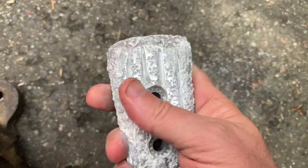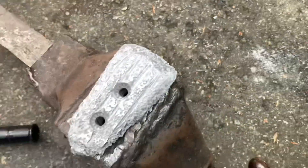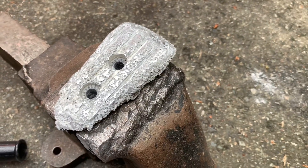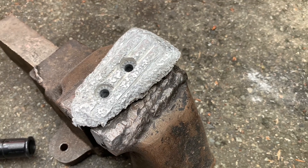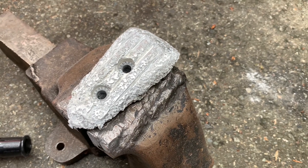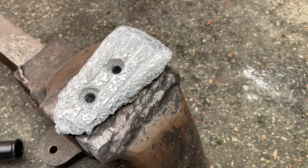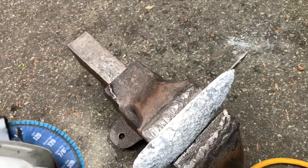This is the kind of thing you need to take care of, because on an aluminum boat without zincs, this pitting happens to the aluminum itself. I think this year I've switched from a zinc anode to an aluminum anode, which should handle the brackish water better. But we'll see — I got this guy rigged up now, just to see what happens.